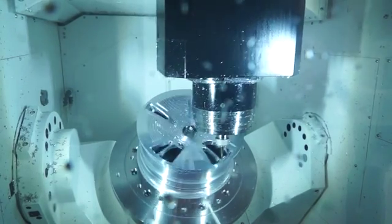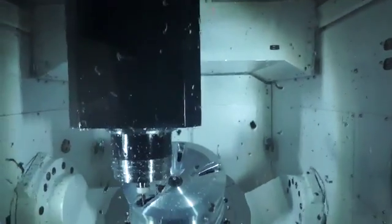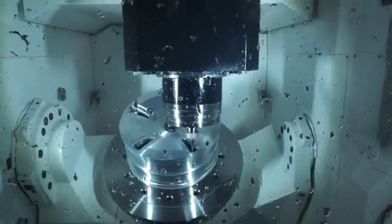So how would this have been done without your software before? It would have been quite a tricky job doing this offline. Possibly you might have used multiple different CAM systems, one for 2D, one for turning, one for 5-axis, and you would try to string them all together and create an NC file. So if you had to quantify how much time it would save you, what would be an estimate? Difficult to say, but I think the other issue is really getting the benefits of the turning. You can collision check the turning against the milling and the milling against the turning. If you keep it all in one environment, then you can come to the machine much more reliably. You press the button, stand back, and the part is produced without any rework or going backwards and forwards between different systems. Let's have a look at a finished part.